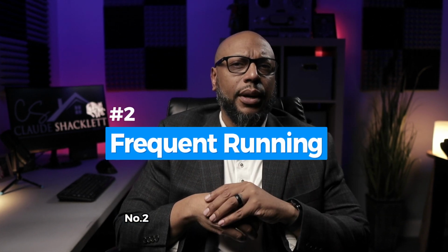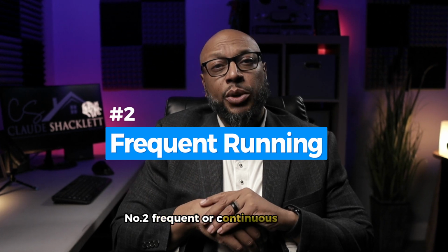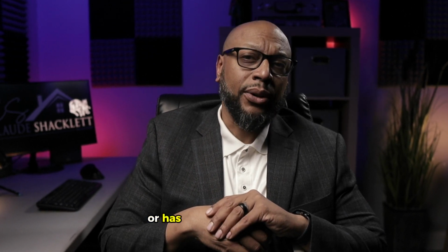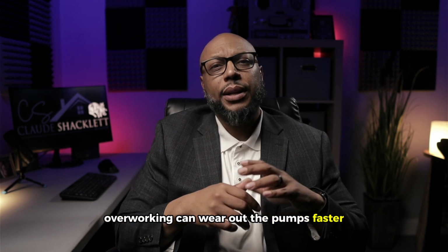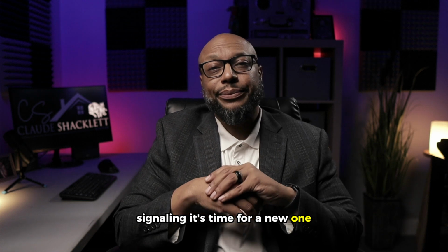Number 2, frequent or continuous running. If your pump runs too often, even in dry conditions, or has difficulty shutting off, it could indicate a problem. Overworking can wear out the pump faster, signaling it's time for a new one.